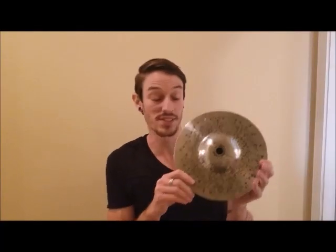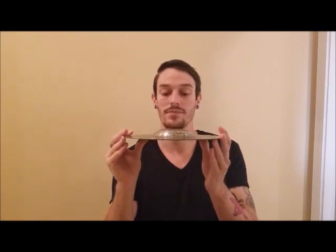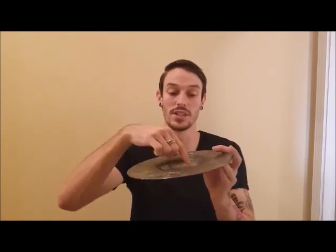Sure you've seen from the sound test that the bell portion of the cymbal is very dead. There's little to no tone from it, and it's very flat. I guess it has something to do with how I stretched the metal to get to that point, by peening it a bunch of times and eventually just stretching the metal. That's probably a big part of why it's so dead.